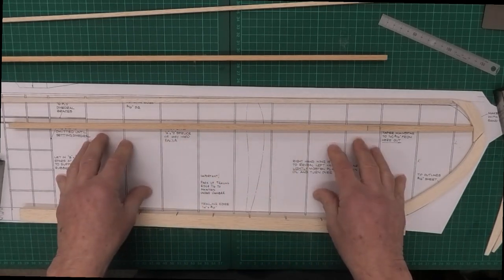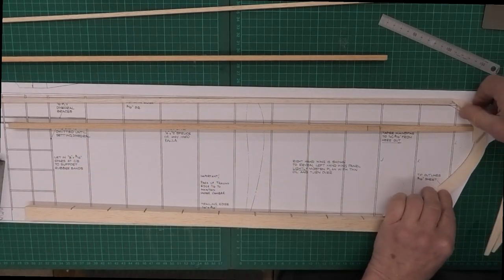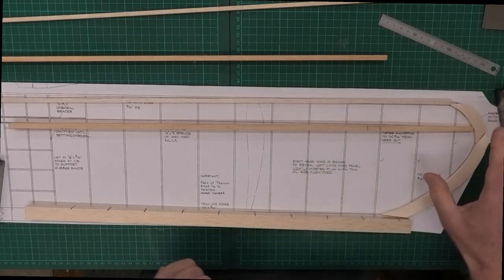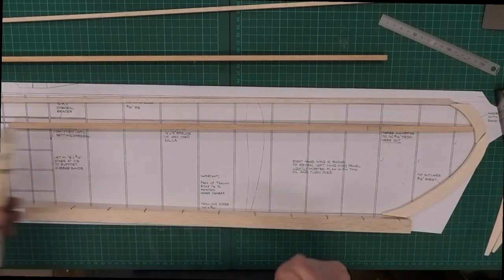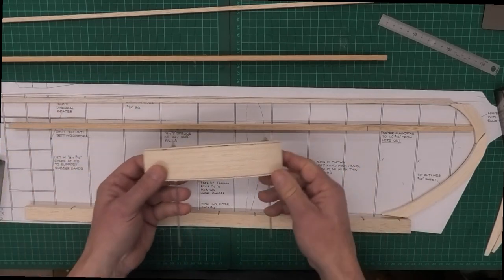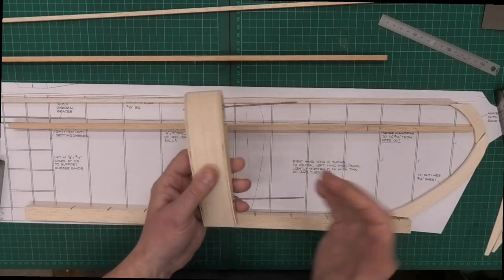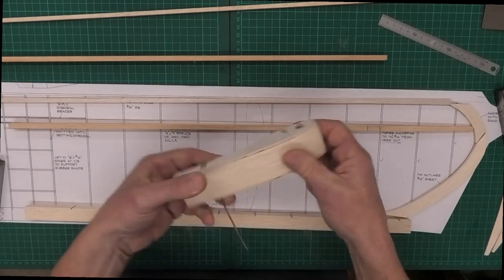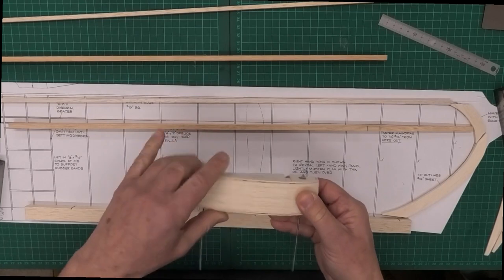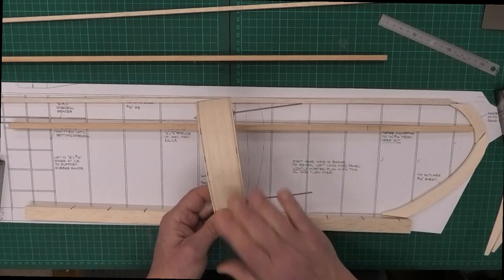Now I think I am going to build over the plans - I'll ignore the rib spacing but it will be useful for when I come to put the wingtip on to make sure I'm getting it in the right place. The ribs I've made using a template - I've made plywood templates or formers and put the balsa in between, sanded and planed that to size, and you get a nice set of ribs. Again there's a link in the description to a video showing more detail on how I do that.